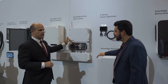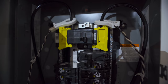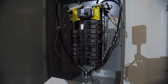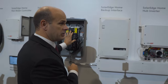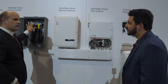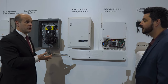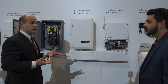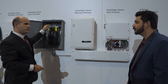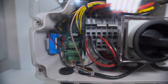One of the new features is what we call PCS — the Power Control System for electric bus bars. We have these small CTs, pretty compact and thin, easy to add on to a load center — even on tight load centers. The inverter sees what's being produced and what's going on in the load center. So you can put a larger inverter on a small load center. Normally a 100 amp load center is limited to a 3.8 kW inverter, which isn't big enough for an electrified home. With the PCS system, the inverter monitors what's being drawn and ensures it runs without exceeding the limits of the bus bar.